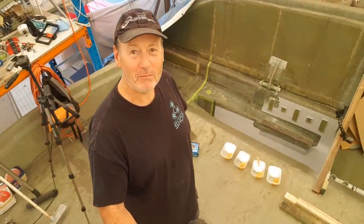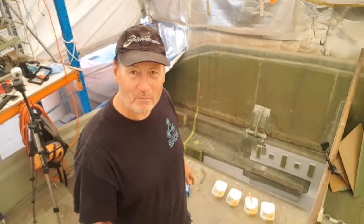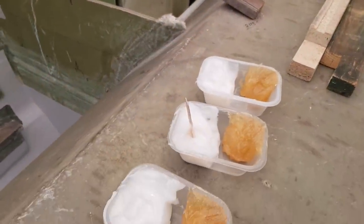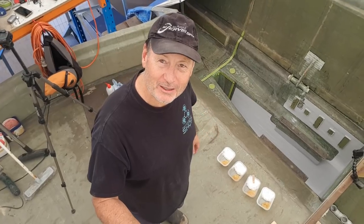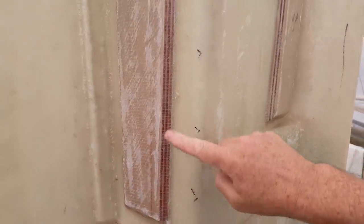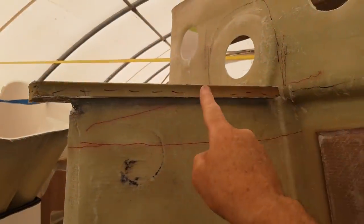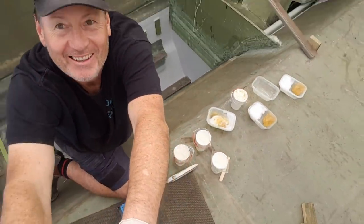The big day has come — it's been a bit of a battle. Down here I've got about 1.2 kilos of Techni-Glue R60, which is a structural adhesive — it's going to hold these modules in place. I've made black marks all the way down on the module wherever I need to adhere, because it's only going to go down once. I've planned it, drawn it out, worked it through my mind. I've got to make sure I get enough material down without adding unnecessary weight. I'd rather tab than use excess glue. Let's get this camera on and go.